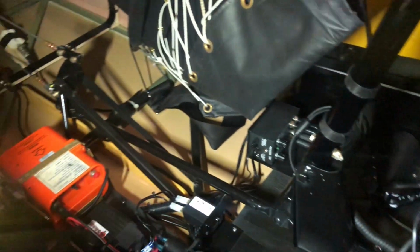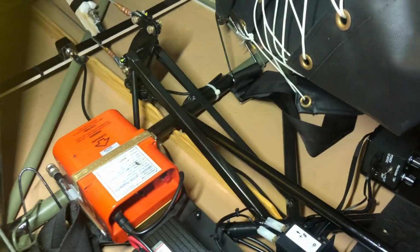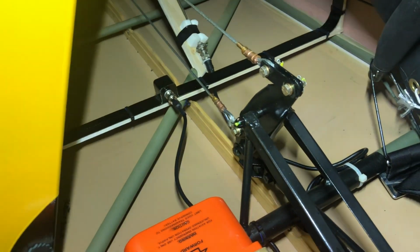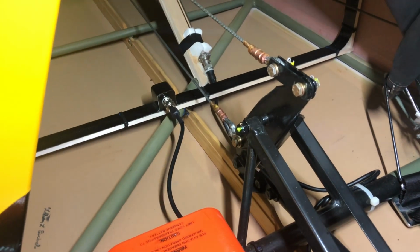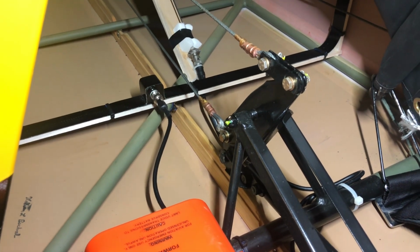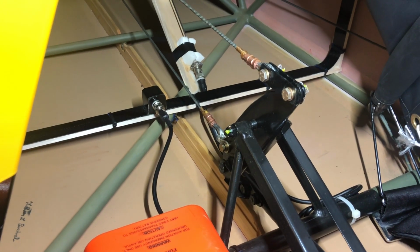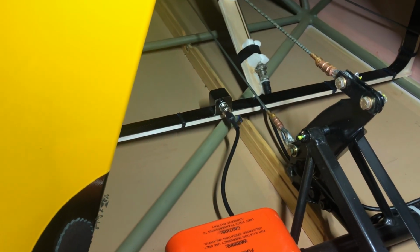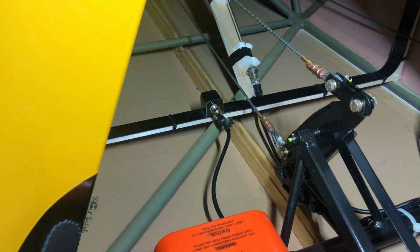But anyways, I just wanted to make a little short video, and on my antenna, I've had a lot of people mention that. So this antenna is almost like a fiberglass antenna, and the guy that makes these, you can actually buy them from Aircraft Spruce, and I will put a link in the description to these antennas. I think they're like 120 bucks. And the SWRs are already set on the antenna where the little box is right there in the middle. And the antenna is 43 inches long.